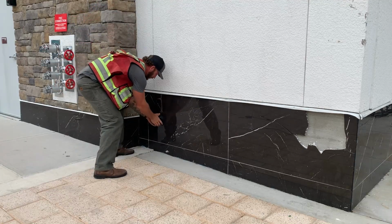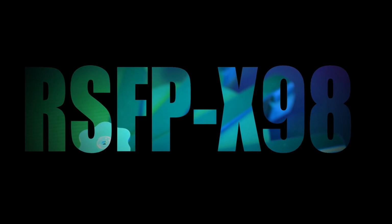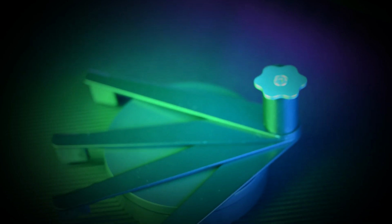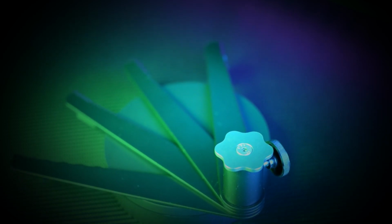Another quick to set mounting point they offer is their floor stand that folds up small and deploys fast without leaving a permanent mark. I love using the stands in situations where I want to set a lot of scan control very fast. Each scan control point takes me about 15 to 30 seconds to both set and tie in with the total station. Before I had these, I would have to set a nail or other well-defined control point, shoot that in with a prism pole or mini, then swap that out with a target pole and paddle.